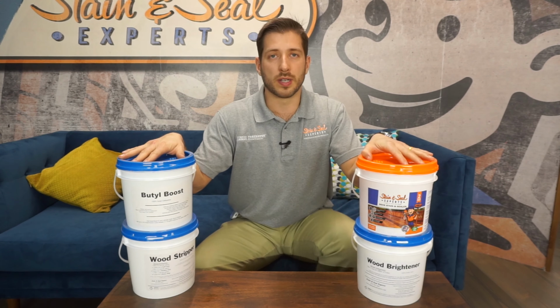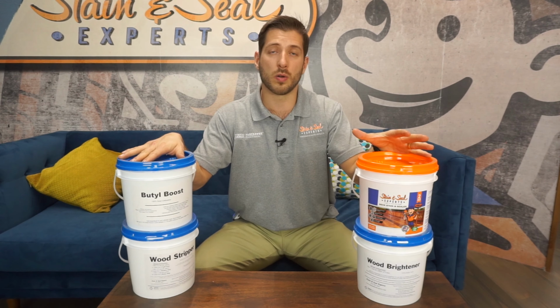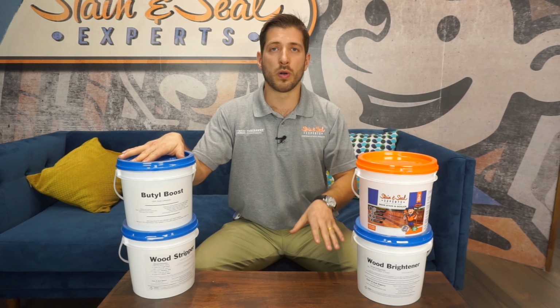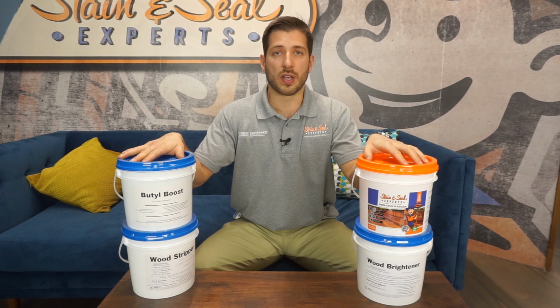I wanted to give you a quick run through of the products we used for this deck restoration in case you didn't catch it in the clip. So we started off with a deck that was maybe 2 or 3 years old, with a 1.5-year-old coating. That was a water-based semi-transparent coating on the floor and a solid color on the bench. As you could see, they started to fail. They were peeling in some areas, and in others they were still intact.